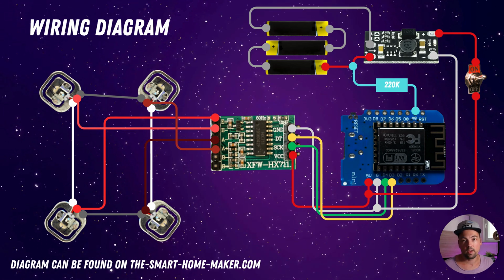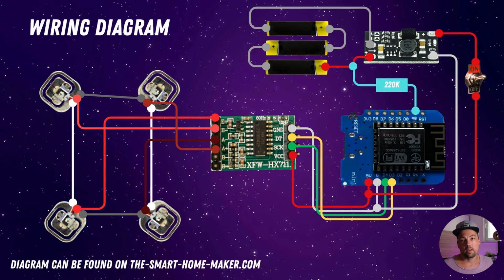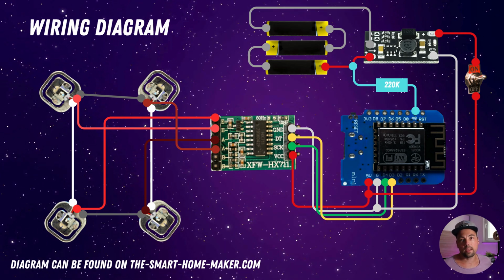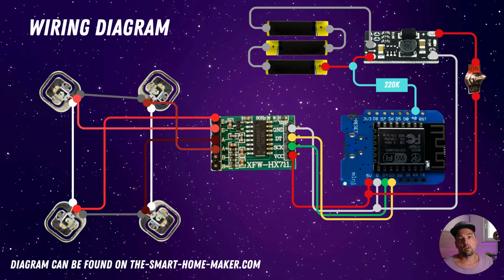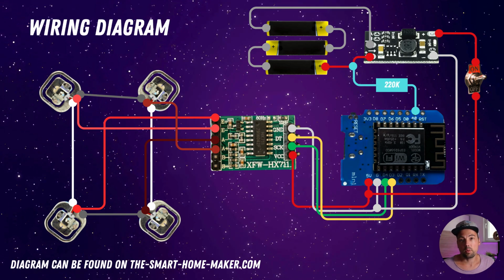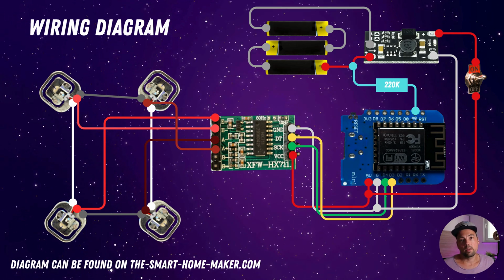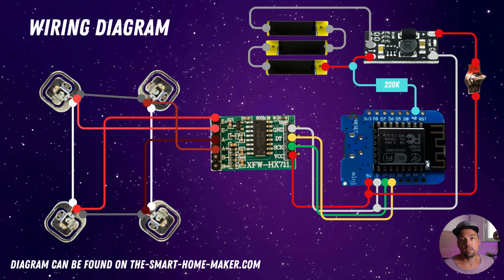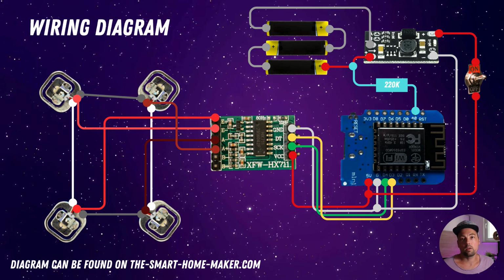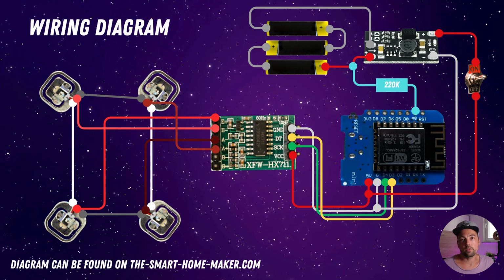The second thing we need is of course some power source, and for that we use the 3 1.5 volts alkaline batteries. We connect them in series so that they add up to 3 times 1.5 volt equals 4.5 volts. Then we feed these 4.5 volts to the DC-DC step-up converter, and from there we go to the 5 volts input voltage of the D1 Mini.